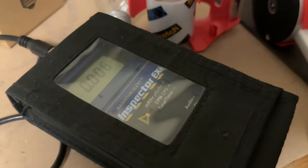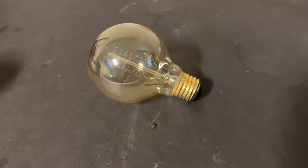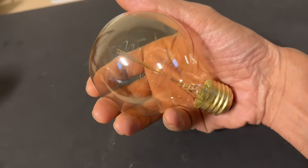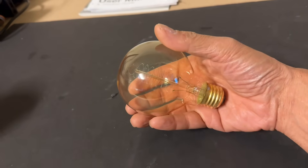I'm repeating it at a distance — I'm way back here and I've reset the meter. This is quite a distance. It's very high — dangerous amounts of radiation. I decided to run it remotely to confirm what I was seeing earlier. It totally drives the Geiger counter crazy. It turns out these vintage bulbs that have a hard vacuum in them are clear winners when it comes to x-ray production, and I don't think I'm going to play with these anymore because of the intensity of the x-rays even at quite a distance.